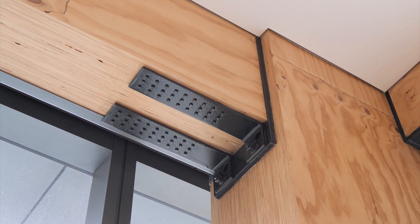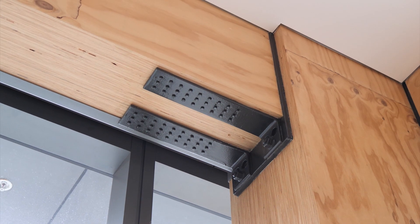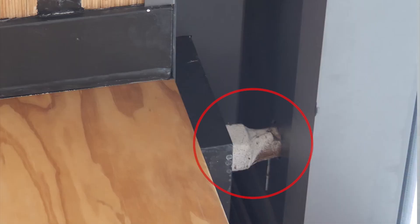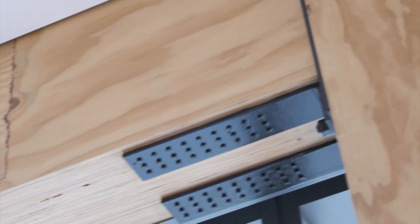Do you see those two black lines? That's from the L bracket - that's the same thing as in the model. It allows the beams to open up slightly if the building were to rock side to side, just like we saw in the model. Tucked up there in the corner is the steel tendon, which acts similar to the elastic you saw in the model, so that one ties all the way through the entire beams, which pulls that building back in after shaking.